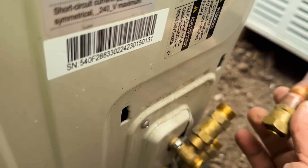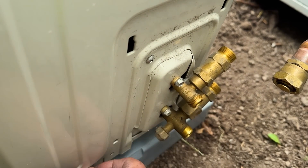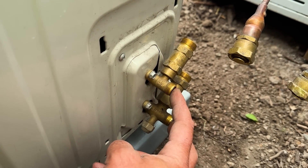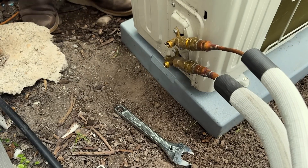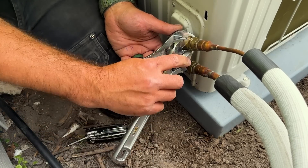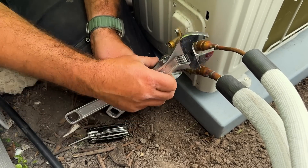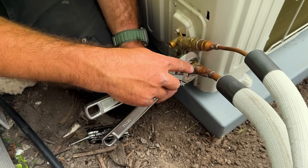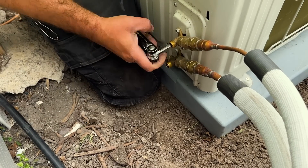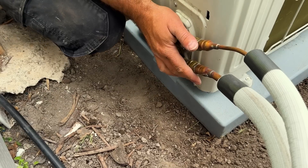It's as easy as reattaching these — I'm going to crank it down. Before we do that, I'm going to make sure that these are both tight, because one of them was kind of loose. We'll verify and check the charge when we're done, but that's not really something you have to do. Once we're done with the refrigerant lines, we'll simply open these king valves and this portion will be totally done. We've got our lines started — just going to do the same thing but in reverse. We're going to hold this down with one adjustable and tighten that with the other. Give that a snug, then move on to our suction side. Refrigerant lines are ready to go. Last thing: reopen these king valves just until they seat. Throw our caps back on and the refrigerant lines are complete.